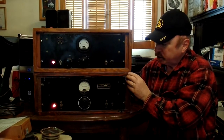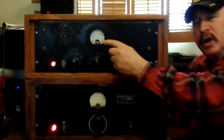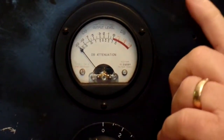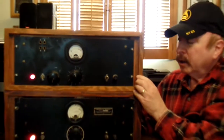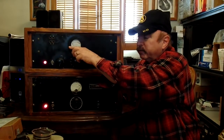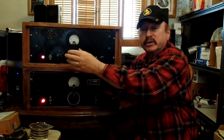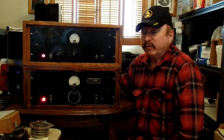The limiter has a unique kind of VU meter: when you're in limiting mode, the needle will rest at zero, and the more limiting you do — the lower the threshold is set or the higher the input gain is set — the meter will start to deflect, showing how many dB have been taken out of the output signal. When you're in bypass mode, the needle flips down to infinity, or zero output, and will come up as you bring the input knob up. The threshold knob will have no control whatsoever since the limiter circuit has been bypassed, and it will show you the actual output level of the device.